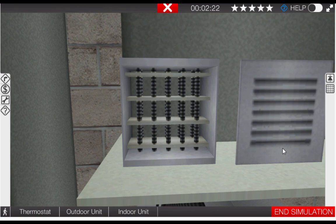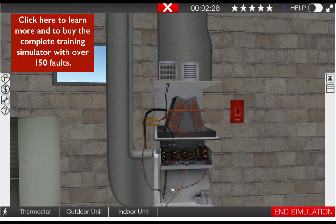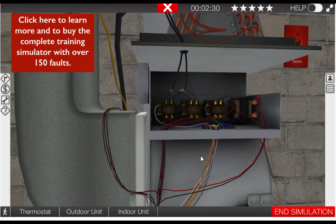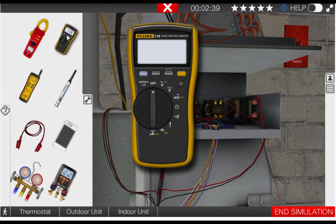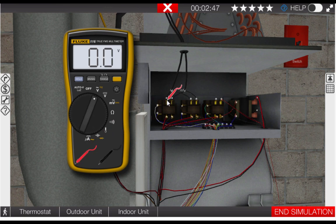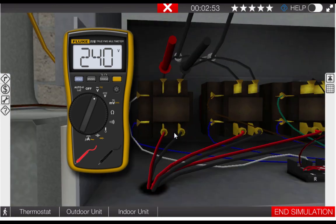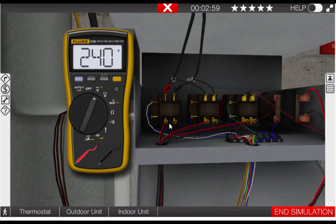Storing the electrical diagram away, let's begin by going down to the control panel. I'm going to right-click to center that in my field of view and see if we have voltage coming from the auxiliary heat relay to the electric heater. Take the volt ohm meter out of the toolbox, turn the selector dial to AC volts, and place the leads at the load side of the auxiliary heat relay. We can see that we do have 240 volts going to the electric heater. This means that not only is the relay functioning, but the thermostat and the relay coil are also functioning.